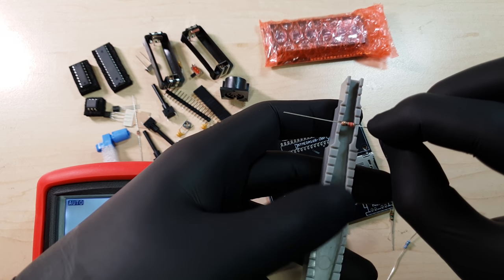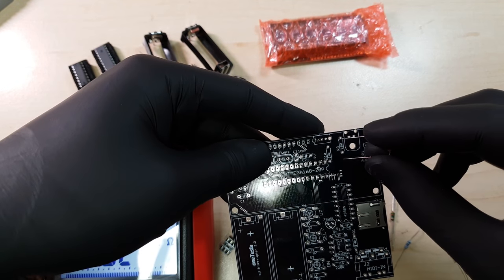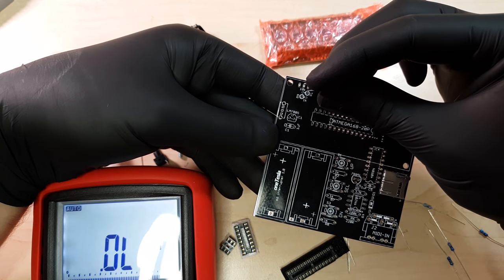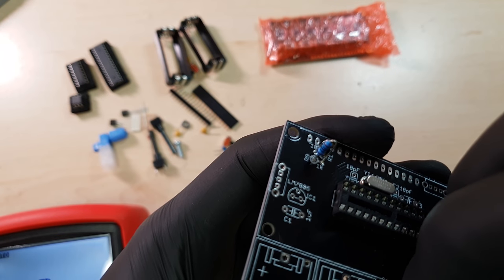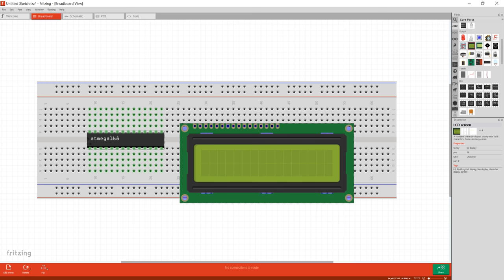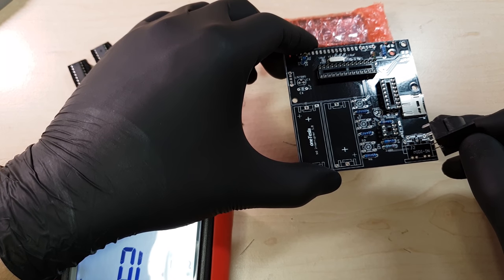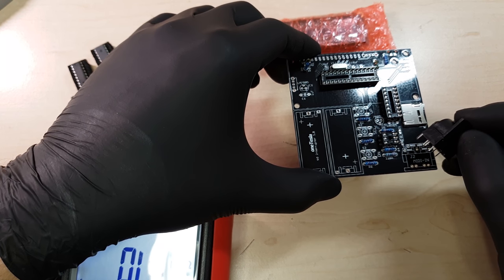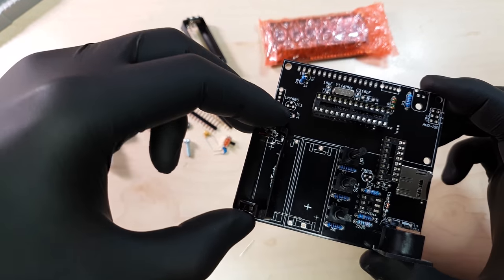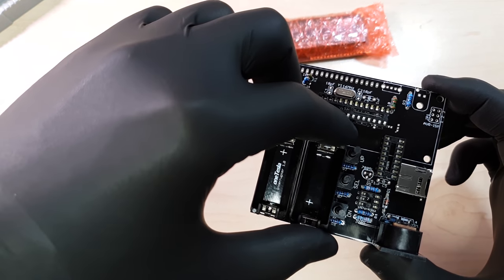The designers have decided to use non-standard footprints for their 5% carbon film resistors, so the ever-popular biegelehre cannot be used this time. In general, properly mounted resistors seem to be a low priority here — these guys are just mounted vertically for no good reason. Who knows, maybe their PCB design software acted up. The presence of an SD card slot and a MIDI input bode well for some advanced functionality, but neither the SD card nor these weird batteries are included in the kit.